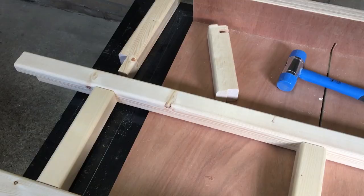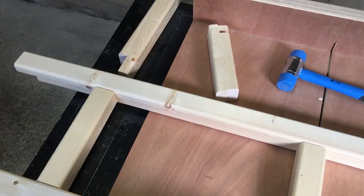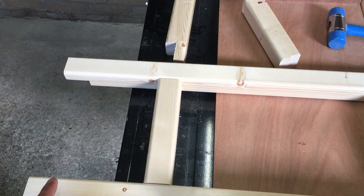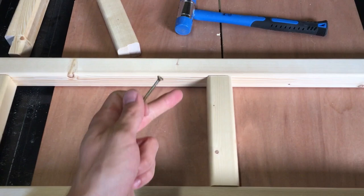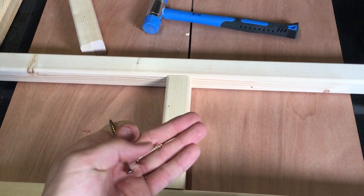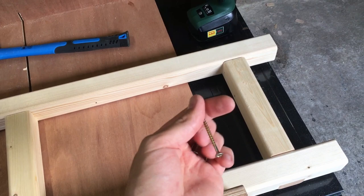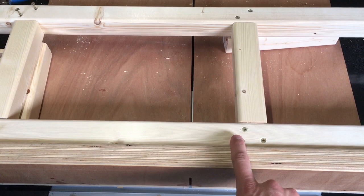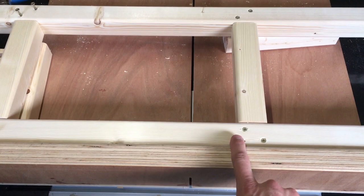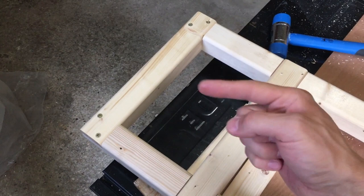I need to position the beams toward the floor in a strategic way. First I position the top of the shelf piece and screw it in with the small screws halfway. For the non-critical piece I do the same with small screws, and for the last one with big ones. This way the screws mark where the beam sets go toward the floor on both sides, I create my structure, and finally go for the last connection. Big screws, small screws, big screws, small screws — from the inside so you don't see them from the sides.